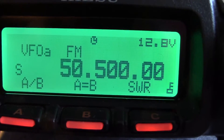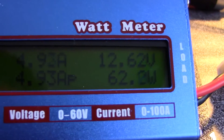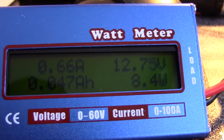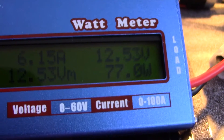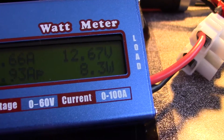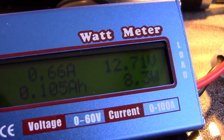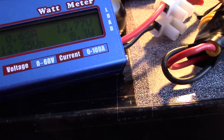I'm going to give it a go on 6 meters, currently at 5 watts RF. Let's see how much power this draws — over 60 watts apparently. We're out on 10 watts: 77. 15. 20. And my dummy load just overheated at 50. My dummy load doesn't seem to be properly heat sunk to its heat sink, so I only get a second or two at high power.